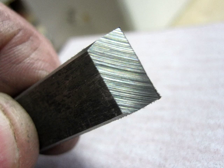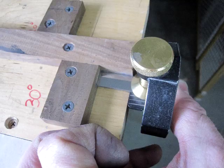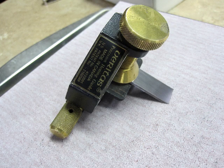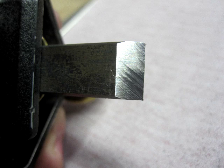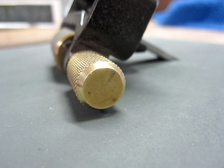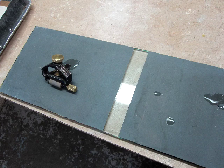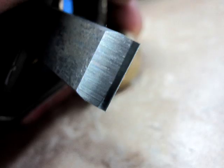It is now time to attend to the bevel of the iron — you can see it has rough grind marks from the grinder. I'll set up my honing guide with the jig I made, which sets the iron at a 30 degree angle. I'll use abrasive sandpaper on the flat and work to get the scratch marks out until they're nice and even. Then I'll use the honing guide to set a micro bevel — with the tick mark up and then down, it slightly elevates the plane, allowing me to use 1500 and 2000 grit sandpapers to put a nice polished edge right at the tip of the plane iron.